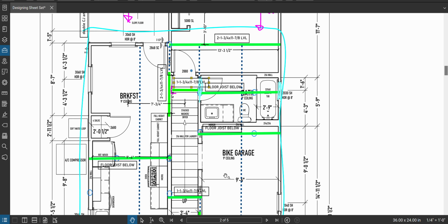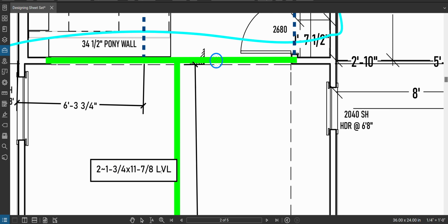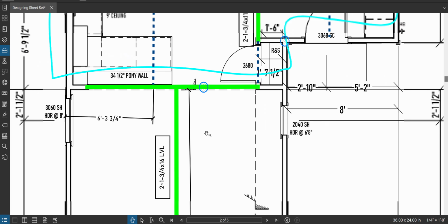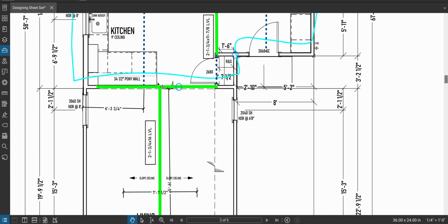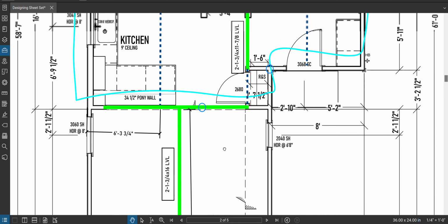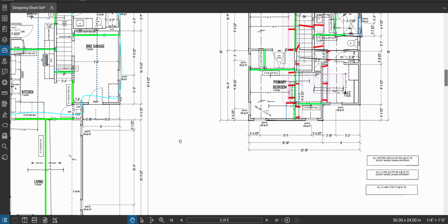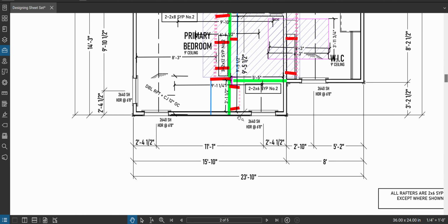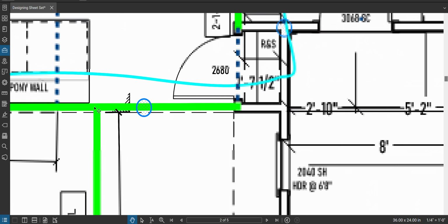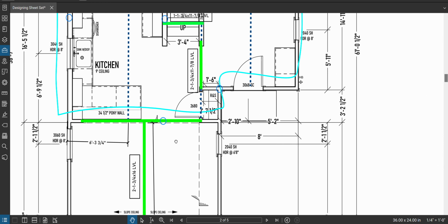And just like that, designed. Okay, great. Let's knock out this one. We're almost done here. Okay, this beam going left to right. Floor is going left to right. What else is on here? This gable wall is on top of that. So we're going to grab the gable wall plus a little bit of roof overhang. Floor is going left to right again. But there's this concentrated load and this concentrated load from this beam. So this is going to be chunky. I'm not going to be surprised if we have to stiffen this up to a 2x6 wall, but let's find out.